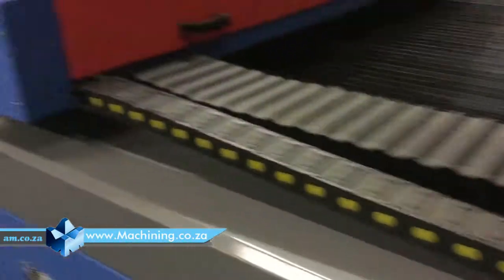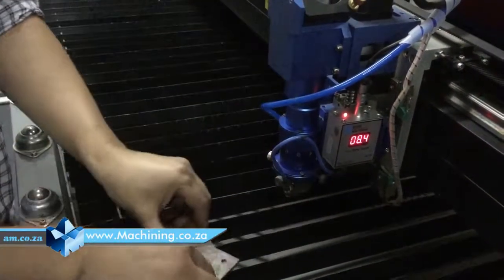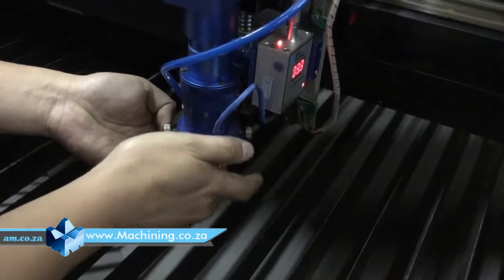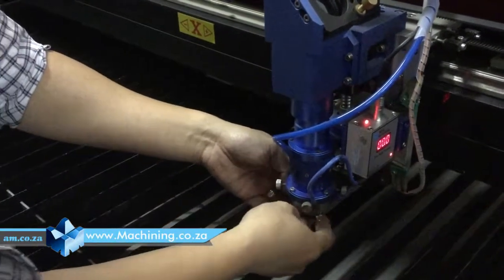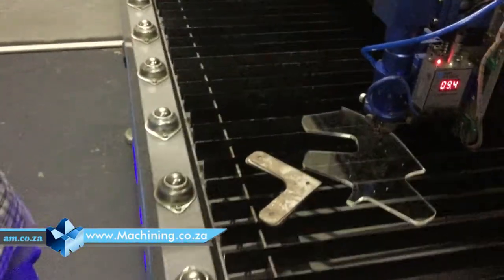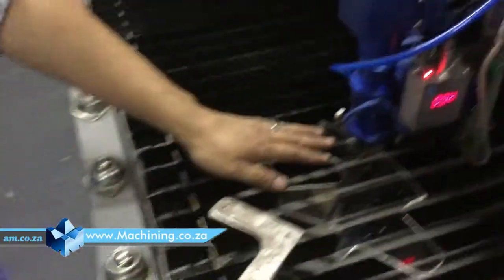And then cutting metal — basically that's it. This is the air tube, to connect for air or for oxygen. If you want to cut normal material besides metal, you change this metal cutting nozzle to the non-metal one, or maybe the aluminium one — they are the same. This non-metal one gives you much more distance so the smoke can get out, but the focus is the same — the focus is not changing. And they also use this nozzle to cut long metal, and you have a spacer that comes with it. You can use a spacer for long metal cutting.